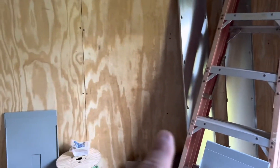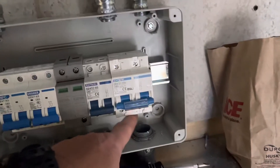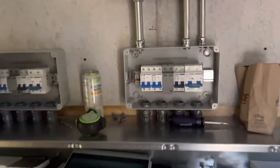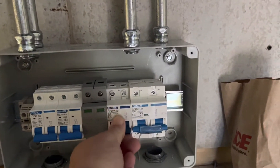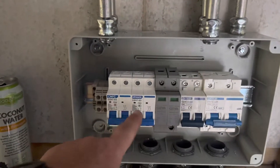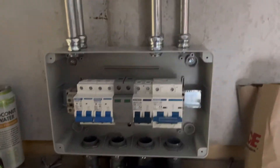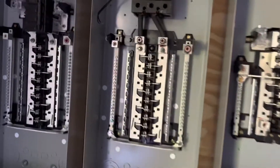The solar array could be mounted out in the field, wires run in — I'm coming in with bigger wire, I'll have a terminal box here and reduce down to smaller wire, come in here, jump over to the SPD, and then up to the PV input. The other breaker will be the battery breaker, and the battery banks will sit along this wall — they'll be lithium iron phosphate batteries feeding in here and ultimately connecting up. I added these disconnects for the battery and for the PV so that from this spot I can isolate any of the inverters.